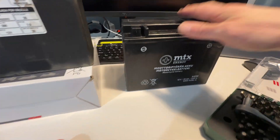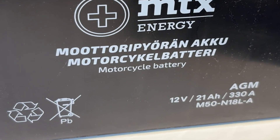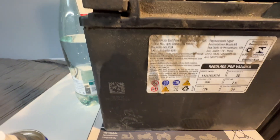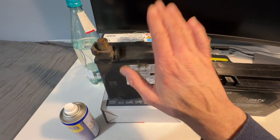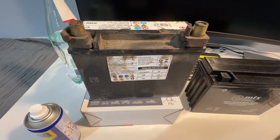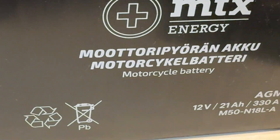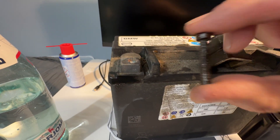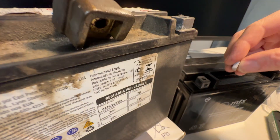It's a good replacement because it's an AGM battery - actually one amp hour and 30 amps bigger than the BMW original. The CCA is over 200 as well. The BMW one is over 200 quid from the dealer but this is close enough. With some WD-40 on the rusted fittings, it's just a case of dropping the new battery in and building everything back up.